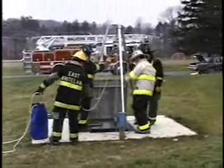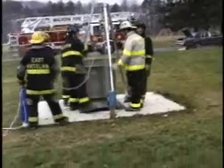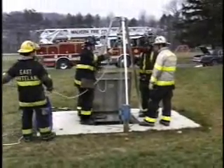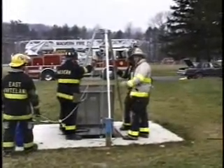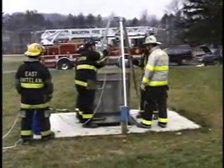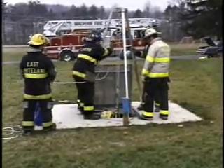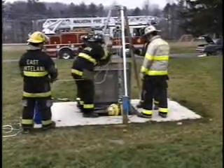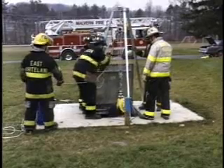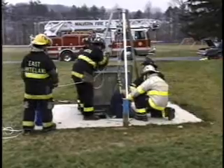The System 9-9, of course, has a back brake that's built into the head. So although it takes 60 pounds of force to do each lifting stroke, when he holds pressure on the rope under the handle — which he's doing with his left hand here, as you can see — that enables him to slide the handle up for his next lifting stroke.